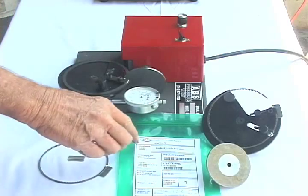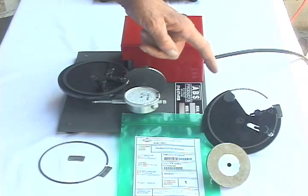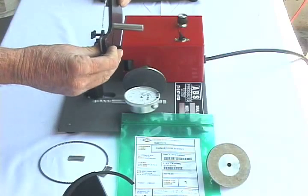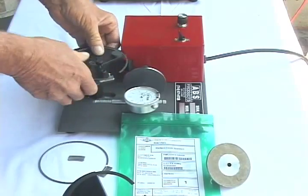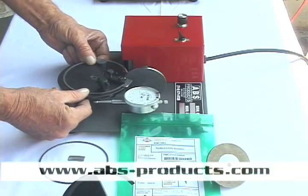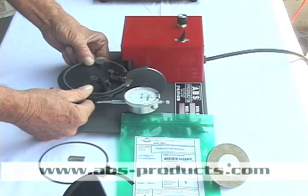Now the newest challenge is that new Dana Moly ring — it's a new Trek oil ring, it's only fifteen thousandth material, and one's got thirty thousandths between it and the other one's got fifty. Well, we developed a way of doing those. They are so thin, nothing else will cut them without bending them. We developed a way to do it — we use this little pot magnet here to keep the back side, they are so flimsy. You take a reading, you want to take five — there's five.